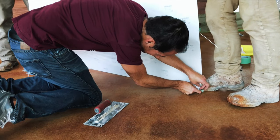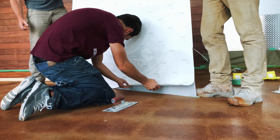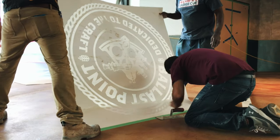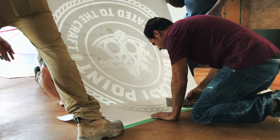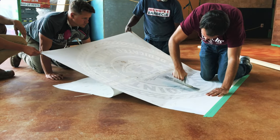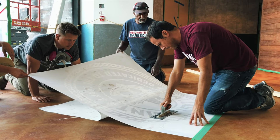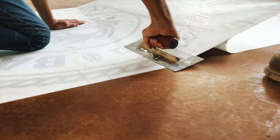After we got the floor stained, they told us they wanted a logo on the floor. We sent the logo off to a local sign printing shop and they cut out a vinyl stencil for us. What we asked them to do was cut the logo out of the sticker and peel the logo out and throw that away — they made it wrong the first time, it came out backwards. Eventually we got the sticker with the logo cut out, stuck it to the floor, and used a concrete trowel to press the sticker down and keep the bubbles out of it. Now we have these plastic squeegee tools made to do this, but back then we used trowels.